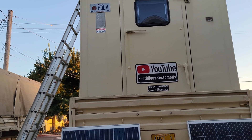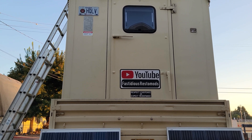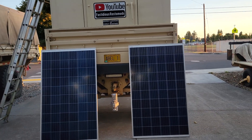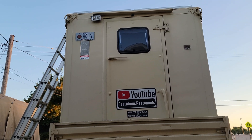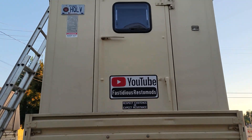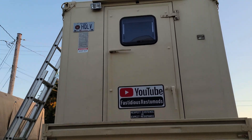This will enhance the solar effect and provide a few more watts. Currently with the 1,120 watts on the roof, the best I've ever seen was 900 watts at the peak of the day, and it only held that for maybe 5 to 10 minutes — because the panels are mounted flat on the roof, so your efficiency is a lot less than if you were tracking the sun. Adding these, I'd expect maybe 400 or 500 watts added on a peak day. In the winter it'll be a lot less obviously. Anyhow, I'm just going to get into it — I have a blueprint in my mind, so let's get started.